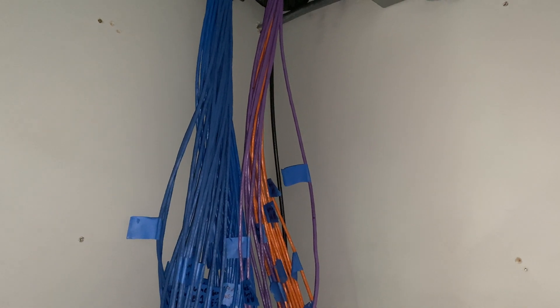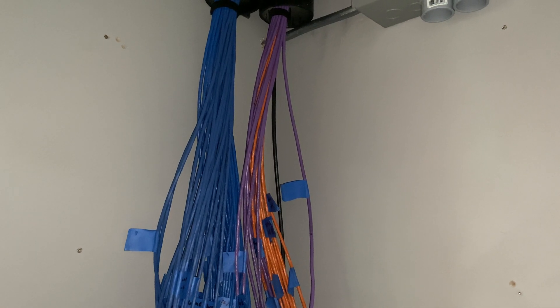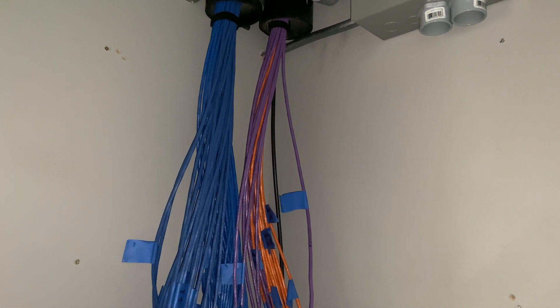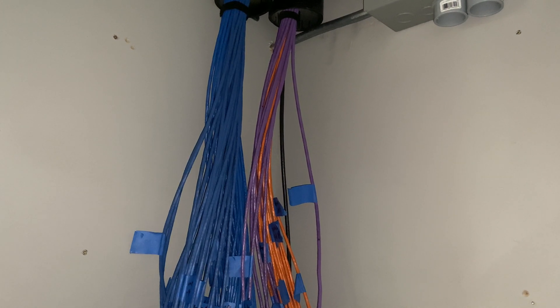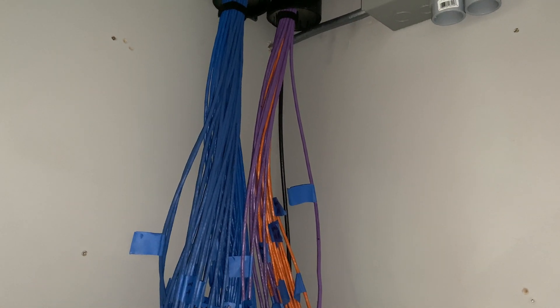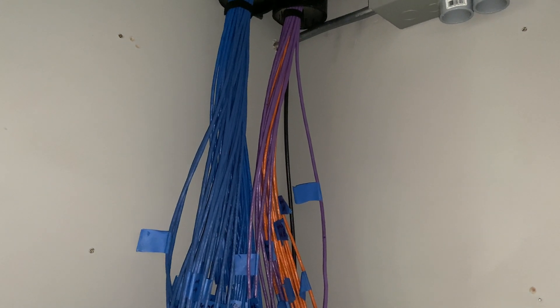The reason I chose these colors: I couldn't find a solid standard for ethernet cable colors — it's pretty much whatever you want. Blue seemed reasonably consistent for general data. Purple seemed to be a convention for security. I chose orange for POE honestly because orange equals power, equals hot — just to let you know that hey, maybe you shouldn't blindly cut into this cable. Otherwise sparks will happen. Ask me how I know.